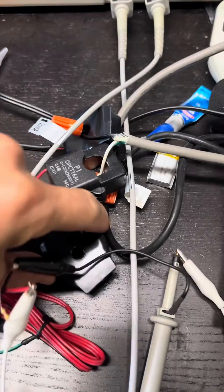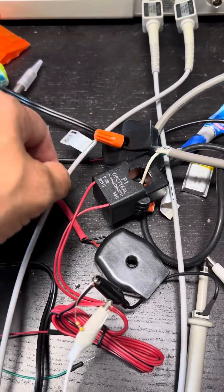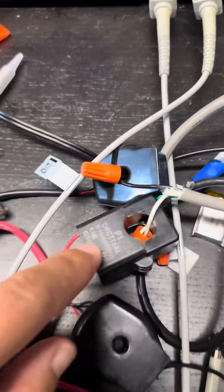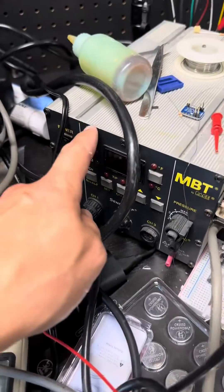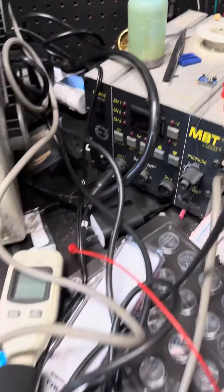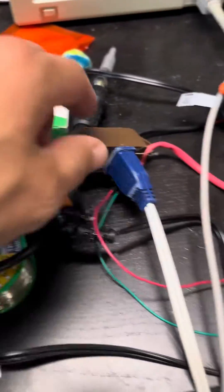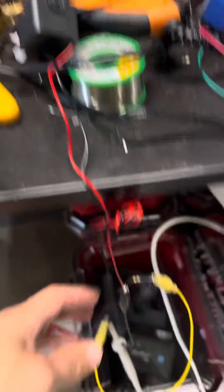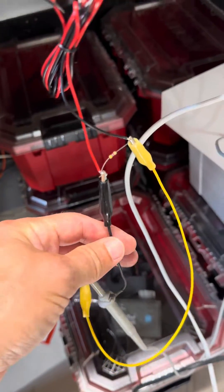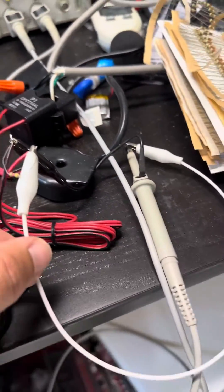This is the test setup. I use these CTs here — this is the CT I actually took out of the electric meter. The only problem is you can't clamp it on a wire easily, but they basically have the same properties. This wire right here goes to a soldering iron, a purely resistive load. This extension cord goes to a box fan, a purely inductive load. I have the box fan wired to this CT, which is hooked to input 2 on the oscilloscope, and I have the soldering iron, the purely resistive load, wired to input 1 on the oscilloscope.